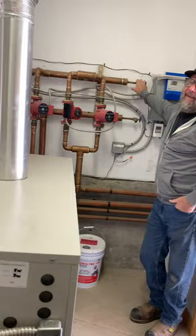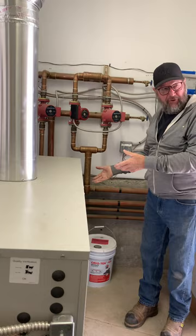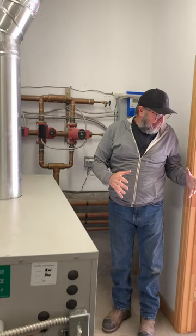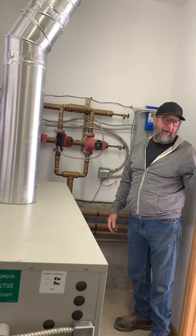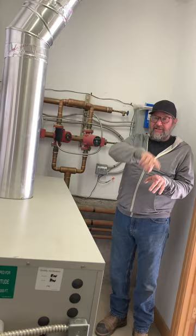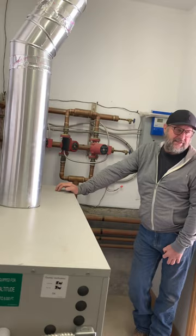I'm not bragging. There's a lot of guys that don't have the equipment to purge. There's no such thing as going out and purchasing something to fill these with. There's not a school or anything. But what I've done is built a pressurized well pump, like you would normally use to pump water out of the ground in the well, and it'll pump to 50 PSI and a lot of fluid. And I can hook that to here and force air out of those at like rocket speed. Because some of my stuff, I'm doing some bridges downtown that are very elevated, and you've got to push that air from one side of the train tracks back to the other side and force it out with, you know, 50, 60 PSI.